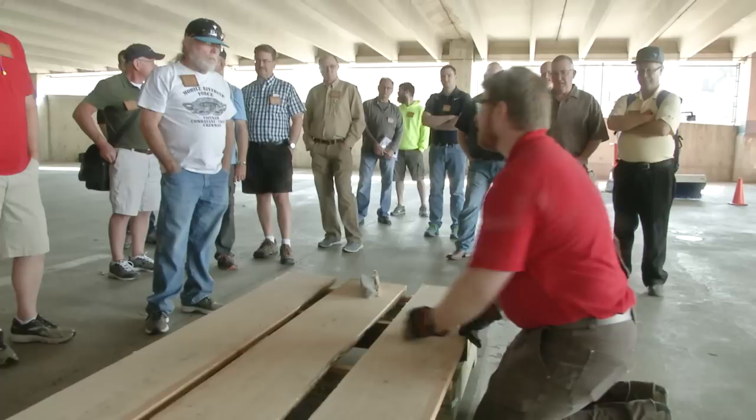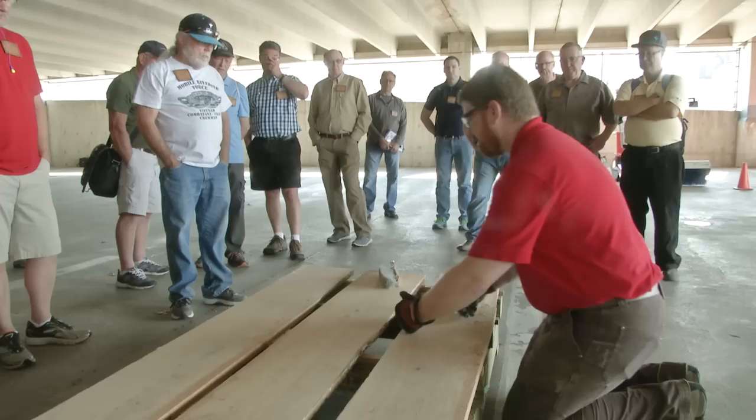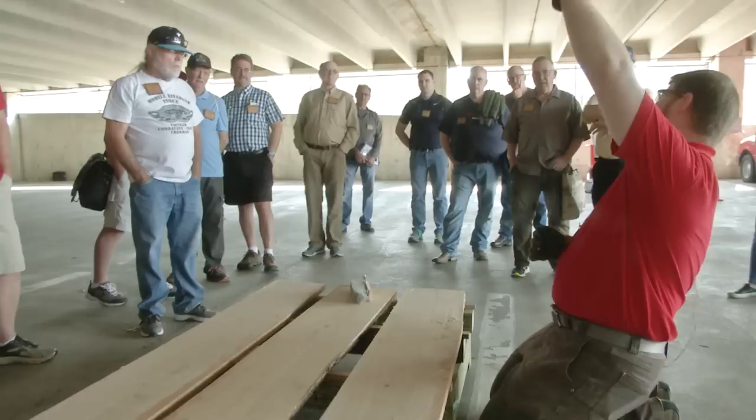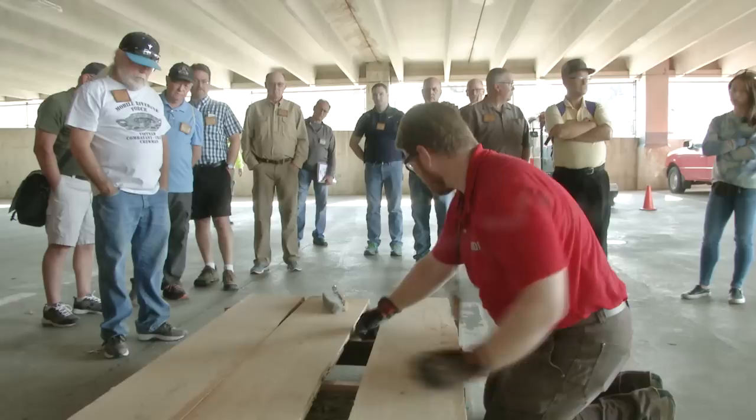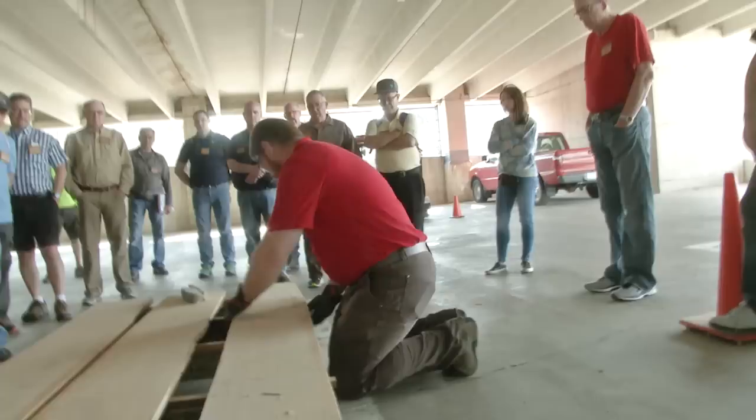It's about the width of your stack and what you cut your boards to. If I cut these to 10 inch I could squeeze four across and maximize it. If I'm wasting space here, and I have a finite number of stickers and a finite height for how high I can take this, you're losing capacity. You could weave in, say, a four inch board right in there. We aren't quite there yet — these aren't perfect examples, but this gets me started.